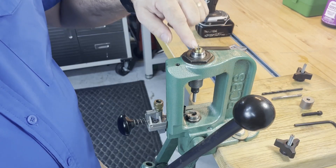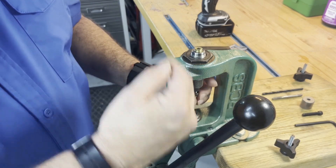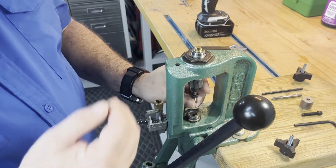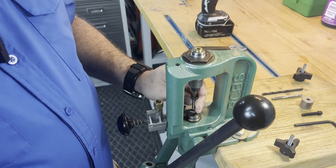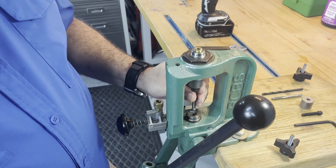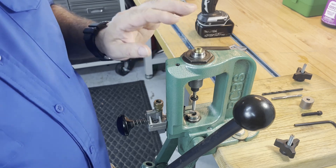I'm going to move some cameras and get some real tight shots. What we're going to be doing is working this end, and I've got a decap pin in the way, so I've got to roll the decap pin out. You've already figured out your expander is stuck inside the case and isn't coming out — that's okay. All I need to do is lower it enough so that my tools, when working through the top edge of this case, don't impact my decap pin. If they do, it's no big deal — I'm probably going to destroy the pin anyway. I can roll that down, and now it's somewhere down here, giving me plenty of room to drill and tap on this end.